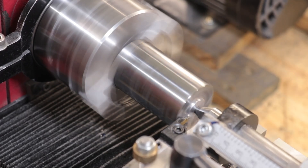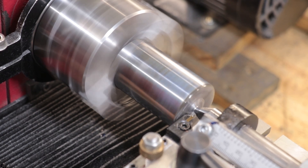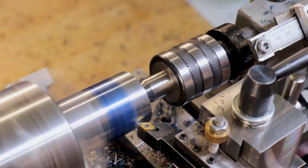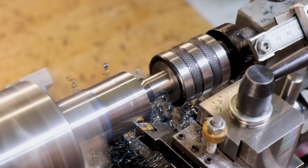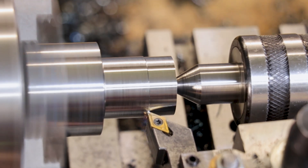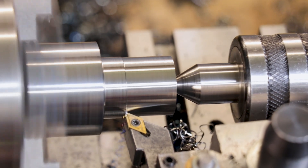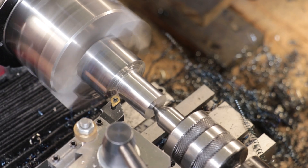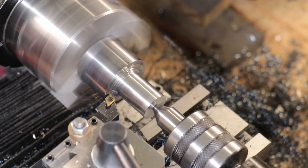Now I have turned 4140 before and I have milled it, but on much bigger machinery, and thankfully it wasn't too much different here. As far as machining goes, it's actually a pretty nice material to turn in that you can get relatively good surface finishes without too much trouble. The only real problem that I run into with my setup is the overall lack of power. I probably stalled the machine 20 or 30 times doing this project, and that in turn tore up the v-belt, which is causing the lathe to wobble, which you can probably see in the footage. But as long as you keep the cutting forces relatively light, you can get some really good results with a small setup like this.